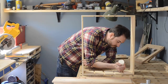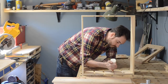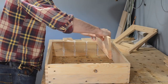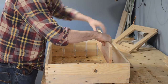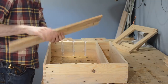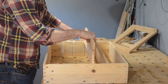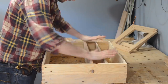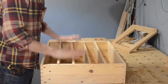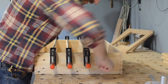I get some wood glue put in the grooves down both sides and then slide the shelves into place. It's quite satisfying when things fit in nice and snug. Even though they fit snugly, I put a few clamps on and leave it to dry.